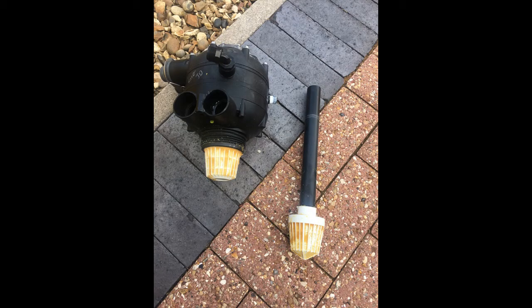Okay, next, stand the bottle in a large container, a bucket, and you can grab hold of the tube that you see poking out at the top of the resin bottle, and you can gradually lift that up and catch all the resin in the container. So you take that out, and once you've taken that out, you've got the head, and then you have the pickup tube or the filter tube together. So that's the next step.